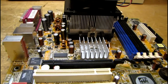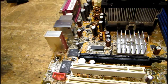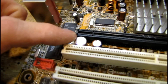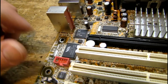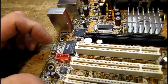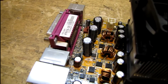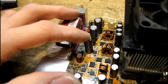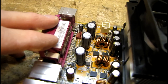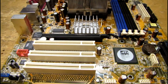It's all recapped now. I did end up replacing the ones that I forgot — I just had to get a little bit resourceful. For that 470 microfarad one, I used a 330 microfarad solid state capacitor. Normally you would never want to go down in microfarads, but for a solid state cap where the impedance is a bit lower, it should be just fine in this application. And for those 1000 microfarad 16 volt, I just used 25 volt capacitors. They're not the prettiest thing in the world, but they'll do the job just fine — they'll probably last even longer than the motherboard will.